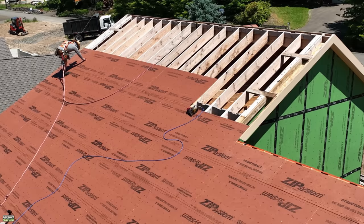Back to the fall protection — you can see the air hose is far to the left, so I don't have to worry about tripping on that. I do have to worry about tripping on the lifeline. Now that I'm back to the middle, I always have to stop and make sure I move it so it goes over the top of the sheet before I lay it. When you have two people on the roof, we like to run one gun on the left and one on the right with hoses from the eaves, and each person has their quadrant — left half or right half. That way your lifelines are not tangling with each other. That's worked really well for us.